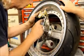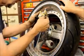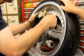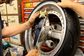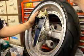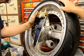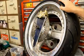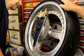But what we're going to have to do is mill a section, a couple of mil off the face of it there, so it's down to 8 mil. If we take 2 mil off that face, it ends up with a slight step in it. Dog leg is a step. Correct terminology. It will then give us a 4 mil clearance. Right, great stuff. Okay, so that's what's next.